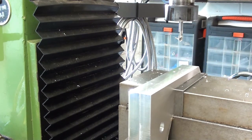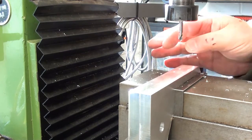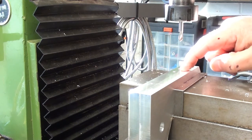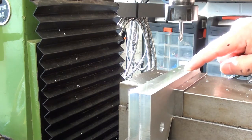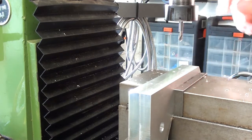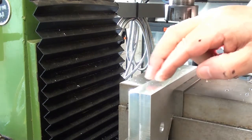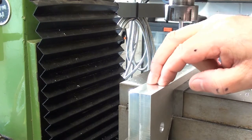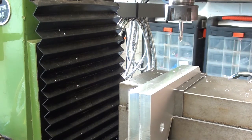I'm going to take those barrel bolts out. I'll change the spotting drill out for, in this case, a 6mm clearance drill. And when I come to do these, these will be for 6mm tapping size, 5.2 or thereabouts. I'll do the drilling and the tapping off camera, because that's even more boring than the last lot to watch.